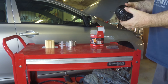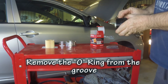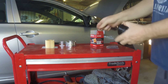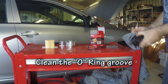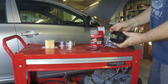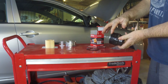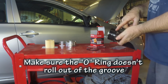You will also need to get the O-ring off. I use a small screwdriver just to get it started and then roll it off. Once started, just roll it off and set it aside. Clean the groove in the housing where the O-ring sits, to ensure there's no gunk that might stop the new O-ring from sealing. Get the new O-ring out of the bag and roll it over the thread until it sits in the groove. Don't push it all the way down — make sure it goes into the special groove for the O-ring.